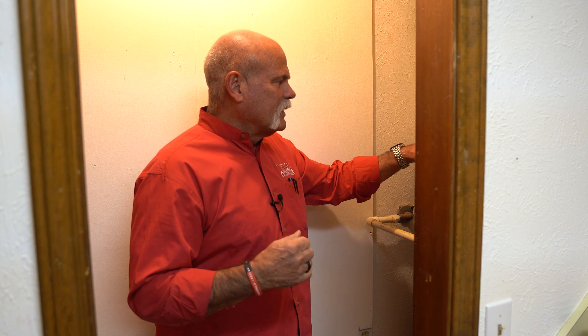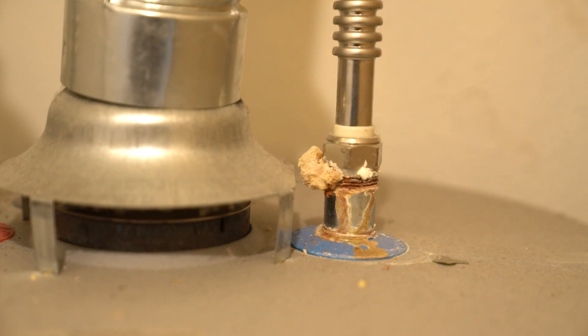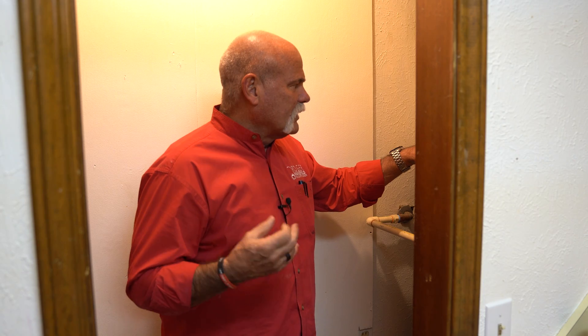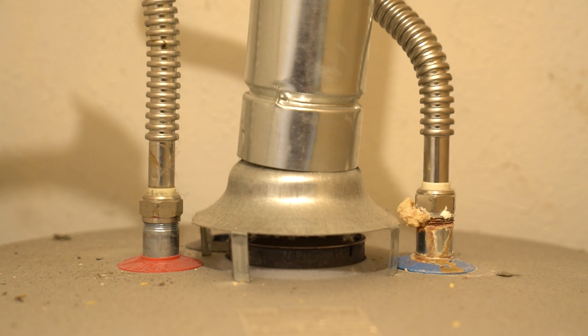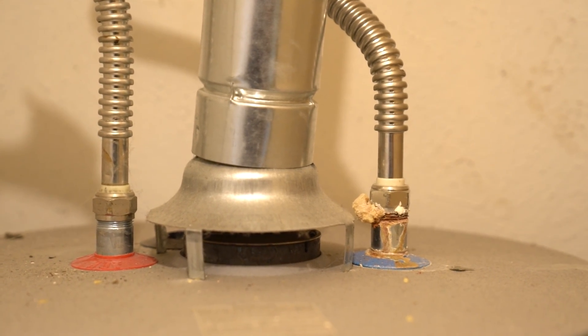One thing that I love about it — but there are a couple of bad things, so let me point those out first. When I see a buildup like this, it's calcium and magnesium. There's a rusted nipple on the top of this — the dielectric nipple's got corrosion on it, and that tells me that this has leaked in the past. Looking at it now, it's not wet, so I don't think it's leaking now. There could be enough calcium and magnesium buildup in there to keep that from happening.